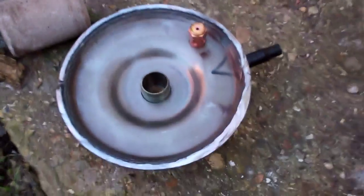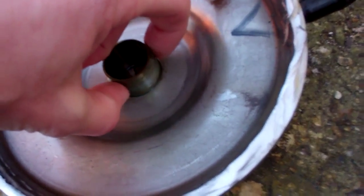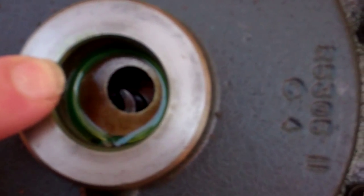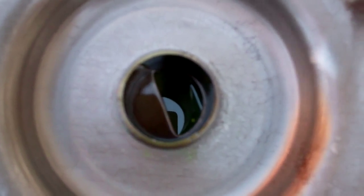Got the top off. There's this little tube stuck in here that seals the discharge port from the suction side of the compressor, sealed with an O-ring. Something interesting — it looks blocked off but it's got a little swing check valve in there.